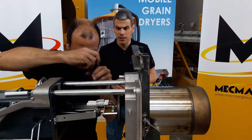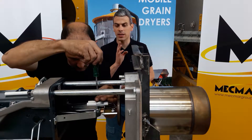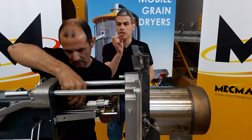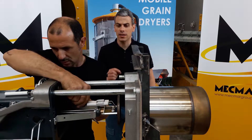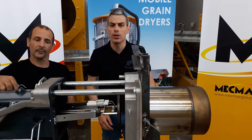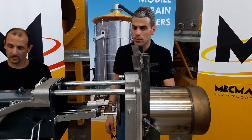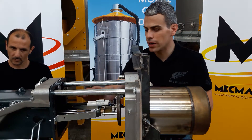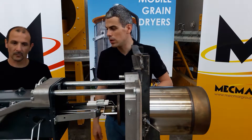When putting the electrode in position, it is important to check that there is always three to four millimeters clearance between the tips of the electrodes, and four to five millimeters side clearance between the first stage nozzle and the electrodes. After this has been checked and the cable connected, we are ready to close the burner and start our operation.